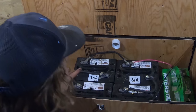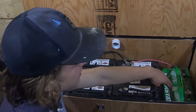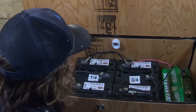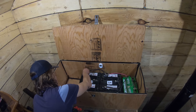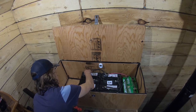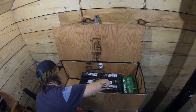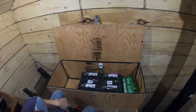I've bored out the connectors so now they fit. Finishing connecting everything — once that wire is connected to the charge controller, our lights will be good to go. That's how you connect four 6-volt batteries in series-parallel. Essentially we have two 12-volt, 225 amp-hour batteries now giving us 450 amp hours. Tightening these nuts — doesn't take much, we definitely don't want to over-tighten them.